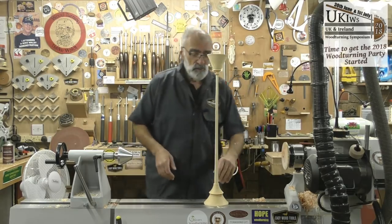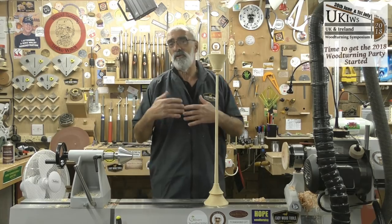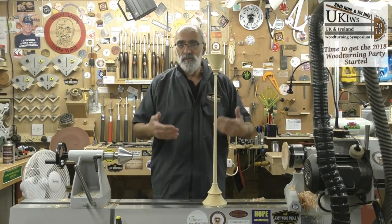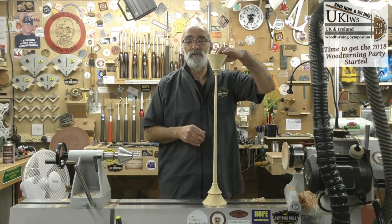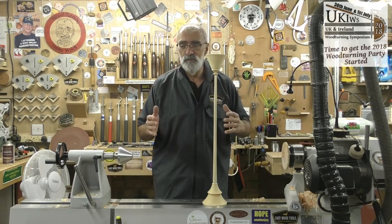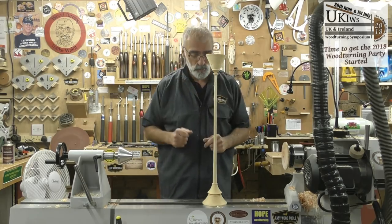So all in all, from a piece of wet wood, it was about 22%, I think, from memory when I started. And of course, I did this over a period of 3 days because of commitments, work, etc., and other things, real life getting in the way, as they say. So each time I wrapped it up in cling film overnight to keep the moisture in, but it did move. The bowl especially, I mean, that's completely dry now. That's about 6%. So that really did warp. So in some of the shots during the filming, it looks as if the whole thing is really out of sync, but the center was okay, if you like. It was just the rim that had warped quite considerably.